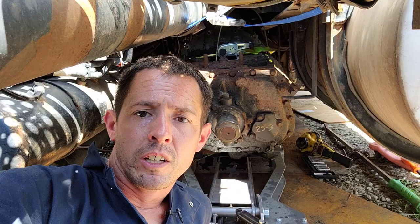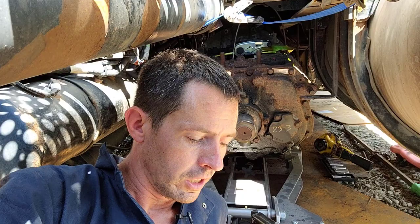All right, so I got that exhaust out of the way, and as you can see, I've progressed forward and it looks like we're gonna be okay. I think when I go back in with a new one, I'll probably put the bell housing on the transmission once I get it inside here. It's just a little bit tighter. But it would go through if I wanted, but just to make it a little bit easier doing this by yourself. So since the dangerous part's over and the transmission's on the ground, my wife left me, so I'm back on my own here.